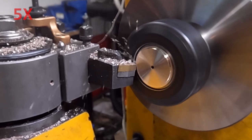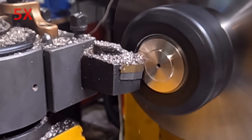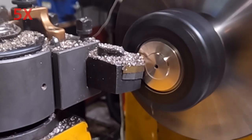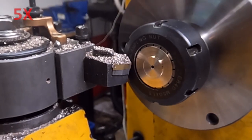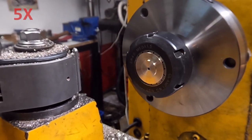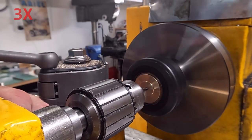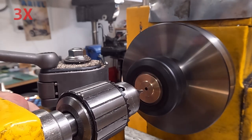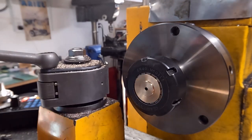This is where I start to notice the center hole is wobbling, and at this point I don't know if it was always wobbling or if it just started. Looking at the video now I can see it was probably the turning operations pushing over a burr into the hole in an uneven manner — but I was thinking the center hole is off, and that's fairly important. The piston rod needs to at least clear that metal; ideally it should be a close fit around the piston rod. I found a center drill with a one-eighth end on it which is fairly rigid and will at least make sure there is no metal in the way of the piston rod. It's no longer a reamed hole and it still looks a bit oval, but that's what I went with — and at this point the part may be scrap.